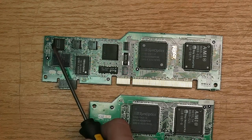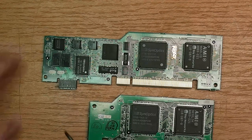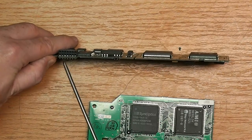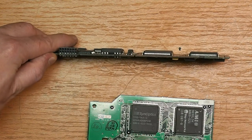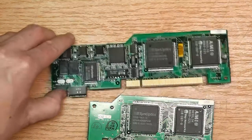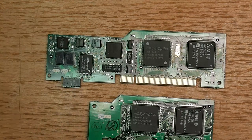So then, after the transceiver, the signal goes down here into that slot. It's just a 3, 4, 5, 6, 7 by 2 standard 2.54 millimeter connector, and then there is only on the main circuit board, we will later see, there's only the transformer, which then galvanically separates the output from the input here.